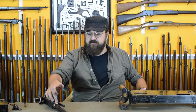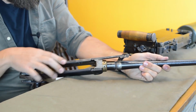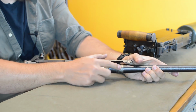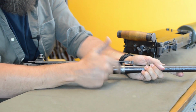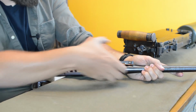And by the way, the reason to leave the front booster to last is that would be where the seal was. We'll talk about those in a minute. But basically, as it is, you've disrupted the rear barrel seal. Let me show you that. So right in this groove here, you would have some asbestos string wrapped around, and then that would seal. All this is water. You can see some moisture on it too. All this is suspended in water. You don't want water coming back in here. So there's an asbestos string that goes here. That keeps the water from coming back while it's moving back and forth in there, and there's a big cowling for that.